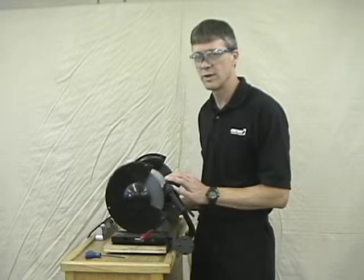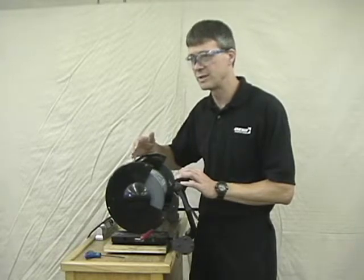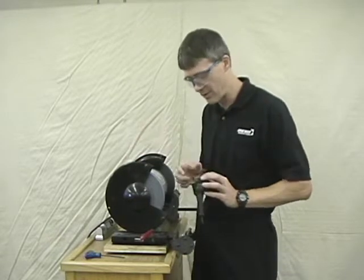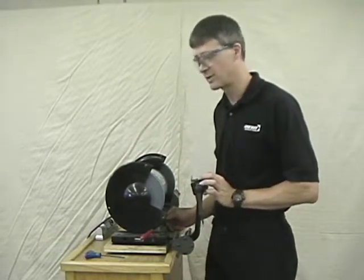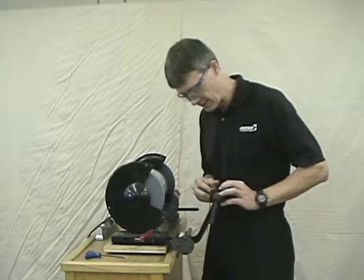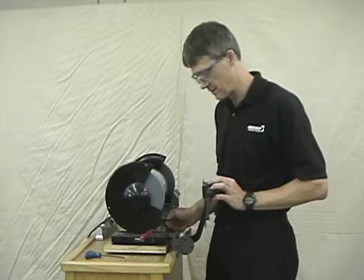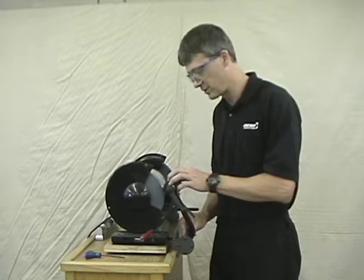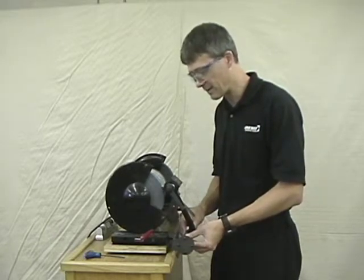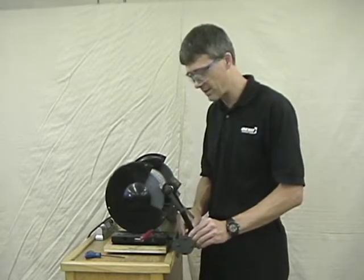In order to ensure that you don't touch the cutting edge, what you should do is turn the grinder on, let it get a little bit of speed going, shut it back off, and then touch the tool to it. That way you can take off a very small amount of material and see where you are. When you're grinding, apply no pressure on the tool — just let the weight of the jig and the tool do the work and slide it back and forth from the bottom. If you try to push it on the top, the jig will bind and won't move easily. By pushing it on the bottom, everything will move freely.